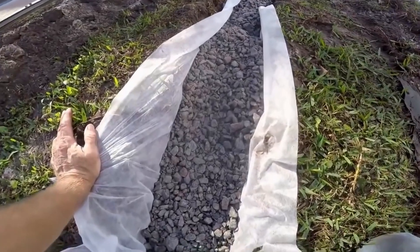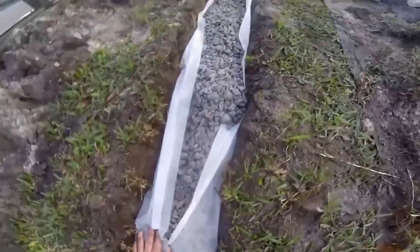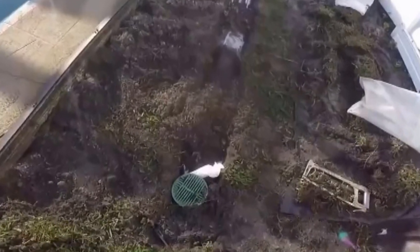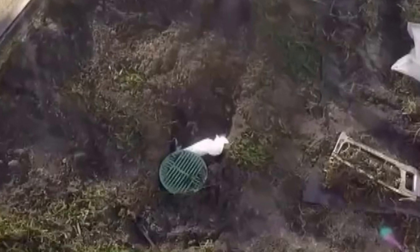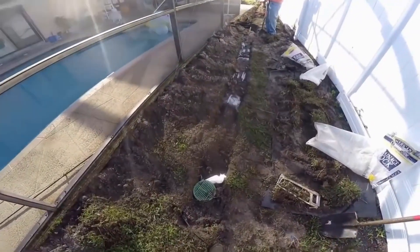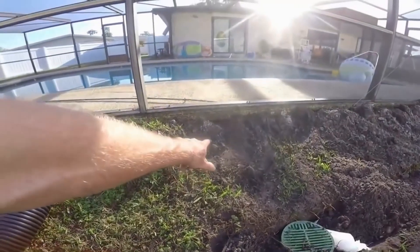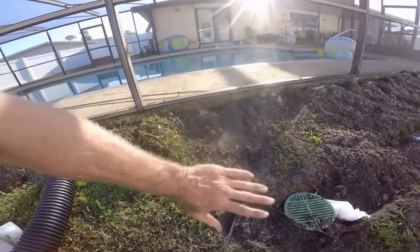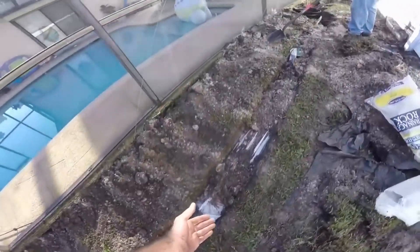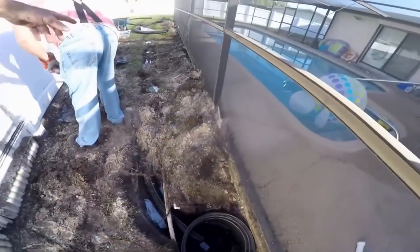This is the low spot between two yards and we need this French drain to collect the water. But we also need those catch basins. We're using a soil separator to keep our gravel contained — and remember, sand is much different than clay. We add catch basins to every French drain. That is so important to make sure that you collect the immediate surface water runoff. Catch basins are different than downspout drains, and you can add them directly to your French drain. So now we're just backfilling. This line starts with the catch basin — because this area has been flooding and eroding. You can see the erosion over there on the pool lanai patio; it's hollow all the way to the pool wall. Basically: catch basin, gravel perforated pipe — people call it a French drain — another catch basin, then we change to solid pipe, and that runs into the sump pit that's going to collect all this water in the backyard.